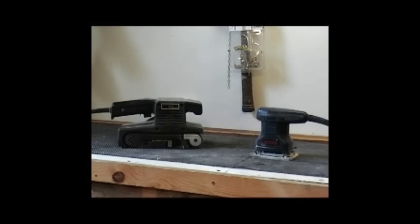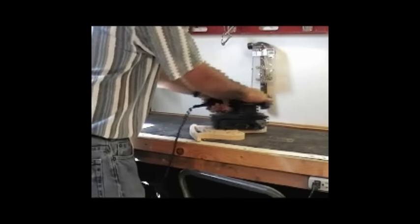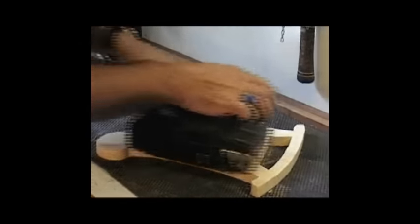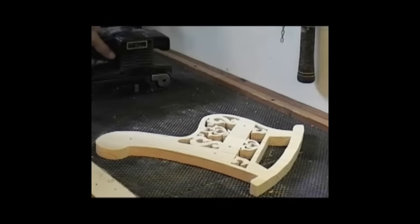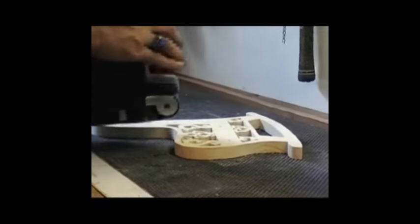When sanding fretwork, use caution. It's very easy to break delicate fretwork with a belt sander, especially if you're working with soft woods like western cedar or, in this case, soft pine. I chose it because it's economical and it's what most beginners will use until they get comfortable scrolling. If a piece has fairly thick and sturdy fretwork, I might give it a quick belt sanding with my lightweight belt sander. In any case, it's a very light once-over, just to get rid of the marks and mars. Be careful though. If the belt sander is not constantly kept moving, it will eat into the wood and leave belt marks. Don't try it unless you're familiar with the particular sander and its own characteristics.